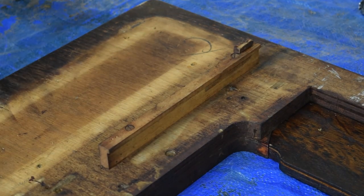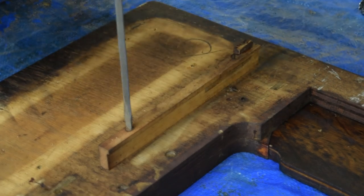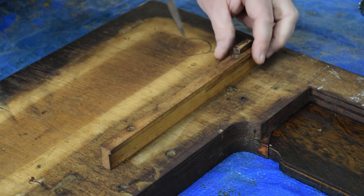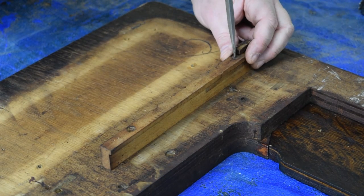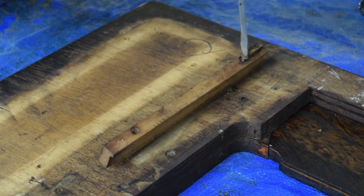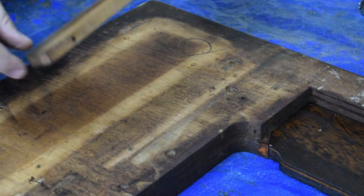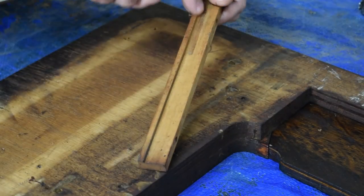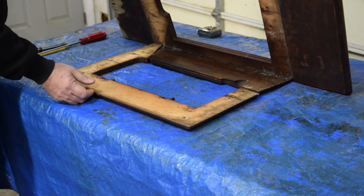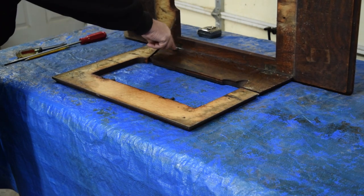And this little piece here is a guide for the slide-in drawer. Some of the models had a flip-down drawer and some had a slide drawer. This one has a slide drawer. I don't know what years are associated with what style. But that's just a simple rabbeted piece of wood that guides the drawer slides and goes right there. And there we go. I have to unhinge this here.